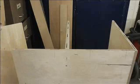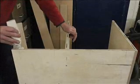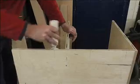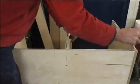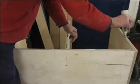I'm part of the way through gluing up at the moment. I'm using this glue dispenser to put glue into the biscuit holes, and I'm only using glue in the biscuit holes. There's not much point in putting it on the edge of surfaces — it doesn't serve that purpose, and it's just messy.